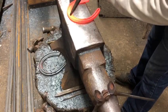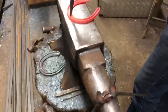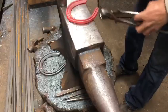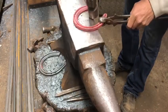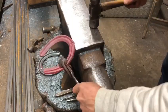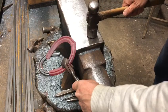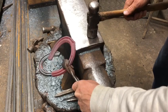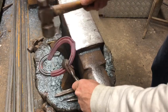I'll pop my bob punch in the required position, I'll lean my hand back a touch and I'll drive it down to the base of the shoe. Then I'll turn it over, flatten the foot bearing surface off, line it up 90 degrees, hold the top edge of the concave section above the edge of the anvil. I'll hold my shoe slightly flatter and then rotate it so it goes square to the anvil, then drive in with the flat of my hammer to draw a flat so it pulls the top edge over.